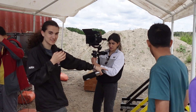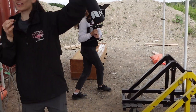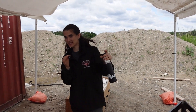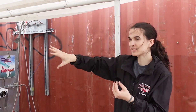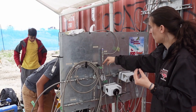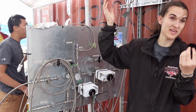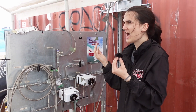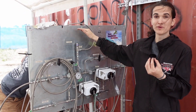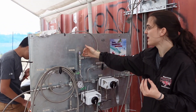The propellants will start on these inverters — they're the gas cylinders in the trailer right now. We'll wheel those out, put those on here, flip them upside down. It's definitely torture to the cylinders. Those contain nitrous oxide, which is like a fairly aggressive oxidizer — loves to fall apart in exactly the conditions we want it to explode in. We will then connect that to this hose, and this panel runs left to right. So we come in this hose, there's a filter. We will read pressure digitally here and manually here — make sure they agree. If they do, then we're fine. If they don't, then that's bad. I think they always have. This guy is a pressure relief valve. If the pressure in here is way too high, this thing will just pop and we'll vent it all.